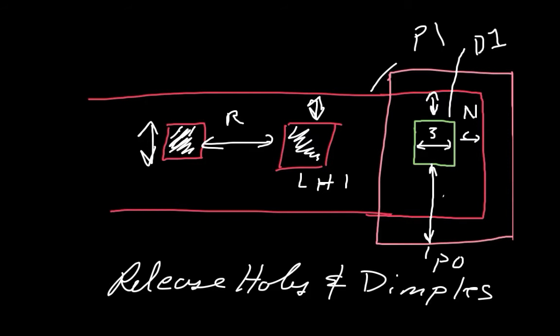Here's a little detail on dimples — this is in addition and doesn't follow exactly the design you're going to do today with the double cantilever bridge. Here's your poly one over the poly zero. You have to maintain this design rule here like we talked about in a couple of slides previous. And here's your dimple — I looked it up and the dimple has to be at least three microns minimum design rule. But you can make it four — typically people make it four by four. Or if you make a circle, you can make it a four or five micron diameter circle. It's kind of nice to use circles sometimes because it looks better on the 3D viewer.